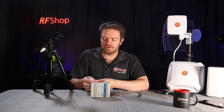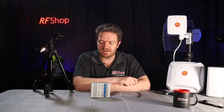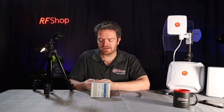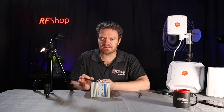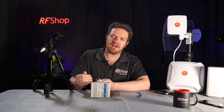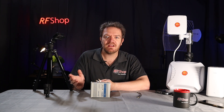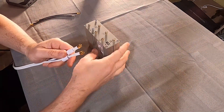That's the SMA. SMA gets used on 4G and 5G technologies — I can't say it's always the case, but it's definitely a general rule of thumb. They are most often gold plated, so you'll see them as gold plated connectors. There's no golden rule for that — the gold plating is not a given. There are silver and stainless steel versions of the same connector type, but for your general applications, I'd say 90 to 99 percent sure it's going to look like this golden connector I have here in my hand.